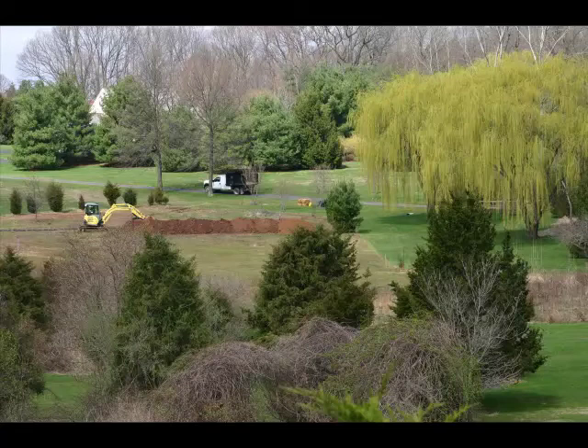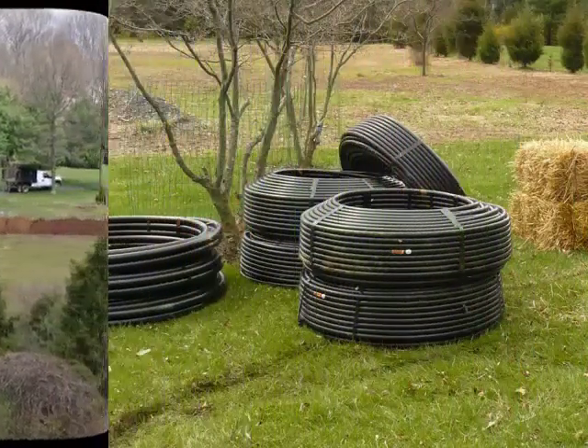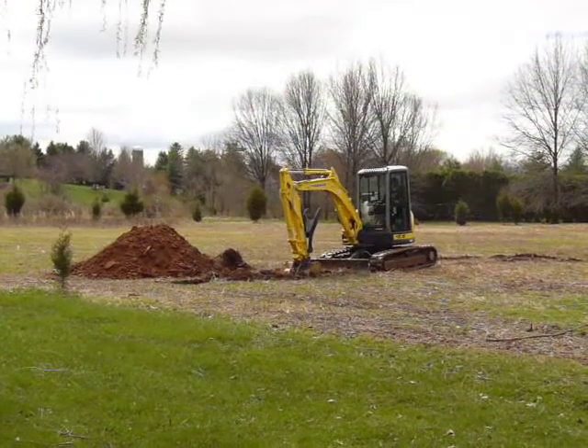So what does that mean? That means two days of digging up the ground, at least six feet down, to lay 5,000 feet of tubing. We're going to show you just how we did it in our home. The goal is all this tubing — five coils of 800 feet and the head of tubing — has to be dug into the ground. We need to put in four trenches to take all these coils.